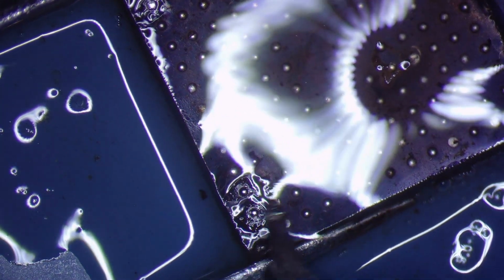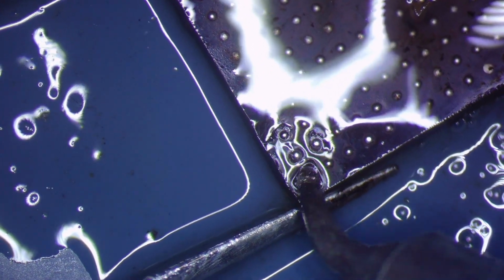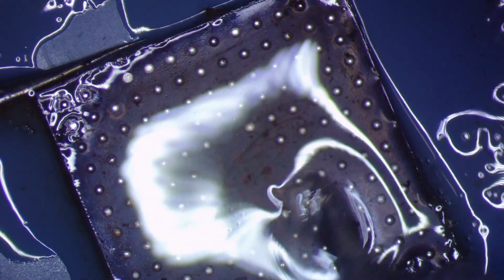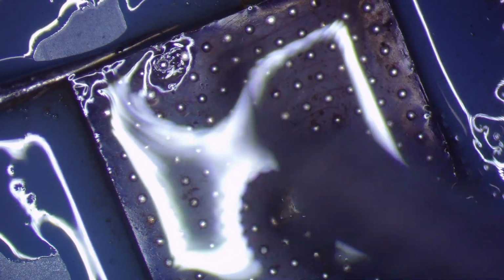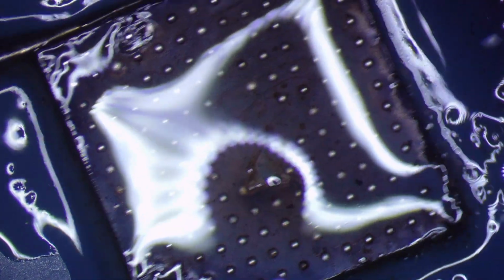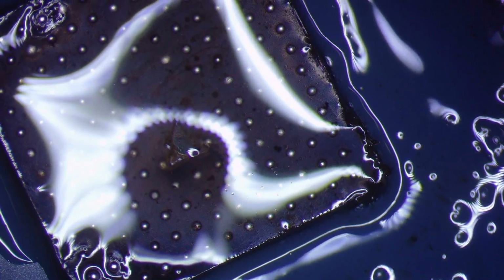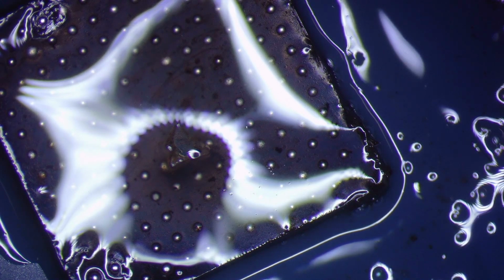And just make sure each one of them are not oxidized. That way when we go to reball it, just like I went over in my last video on the CD3215s, that they all accept the new solder. Beautiful. I think that's all of them. Ooh, one more. Right there. Awesome. And now I'm going to go through and wick it. Wicket, wicket, wicket. There we go.